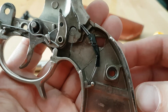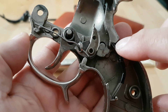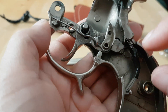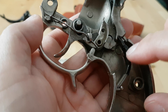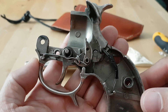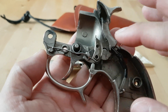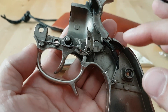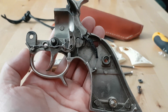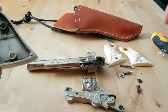If you do a close-up you can see there are two or three tiny long thin pieces of sprung steel in there. I made a kind of U-cap on both ends just to hold them all together — actually quite simple. You could buy this spring online, and I think I found it online, but with postage and everything to Austria it was just too much. So I thought I'd have a go and make it myself, and it works — I was happy to have a go at that.